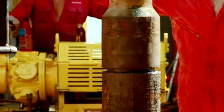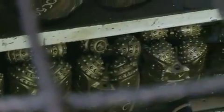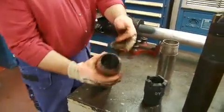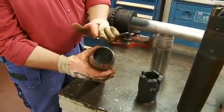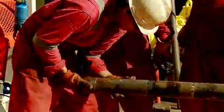At the lower end of the drill string we have a drill bit — that's what cuts the formation — and the core barrels extend outside and work in conjunction with it. On the very bottom of our APC core barrel is our APC cutter shoe, or cookie cutter shoe. As you can see from the interior, it has a very sharp, tapered profile to act in a knife form — it slides in and slices into the core.